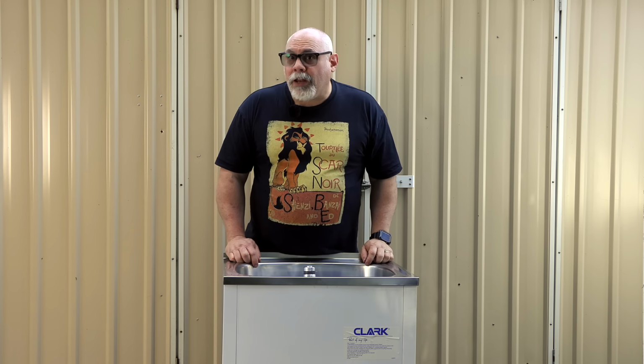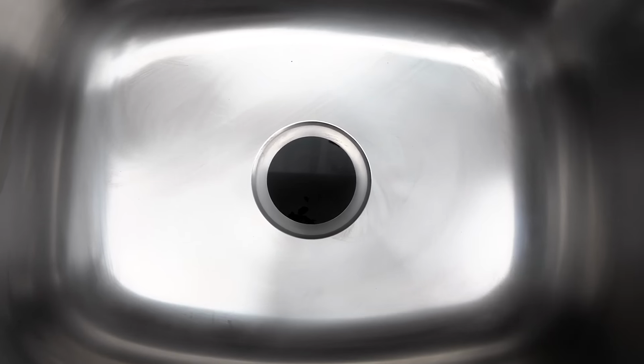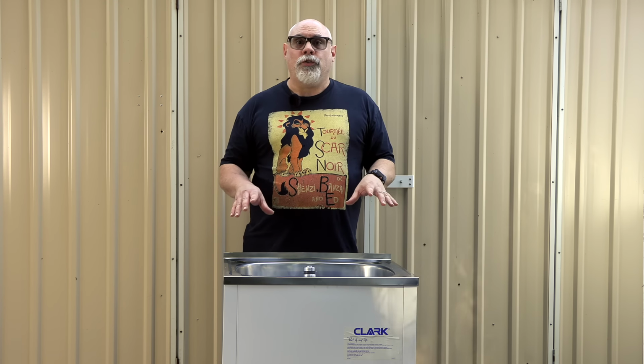I have a small challenge with this tub, as it has a drainage hole right in the middle, which prevents me from placing a transducer there. So I need to try and position the transducers so they are reasonably equally spaced around the area I can use. This is a 60-watt transducer.